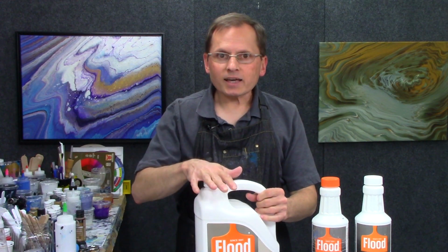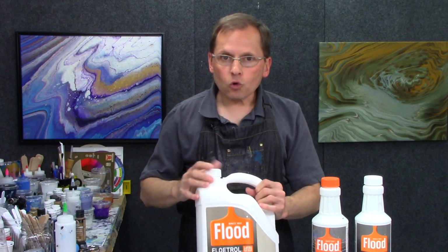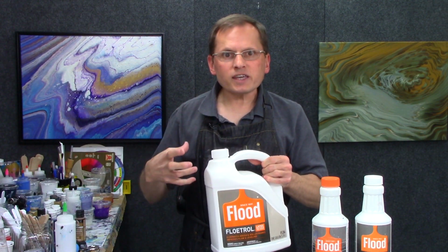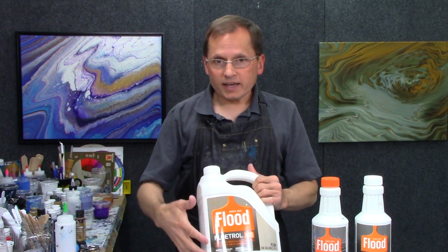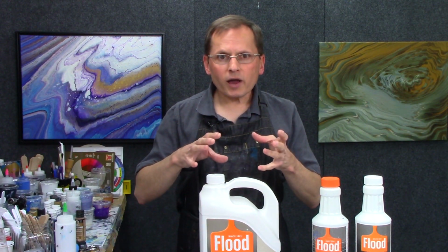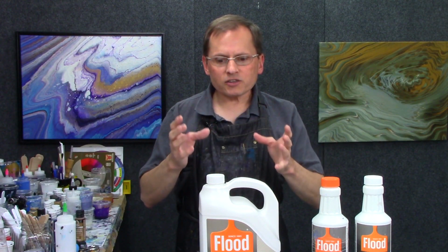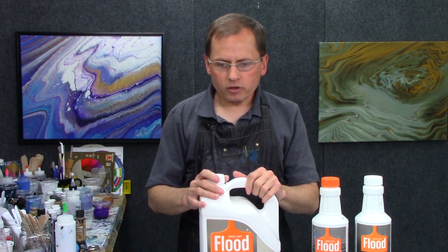So I always kind of test and look at my Floetrol before I buy it. The other thing that's notorious with a Floetrol is it can develop chunks and stringy things in there. And I have a feeling it's because of the latex nature of this product. I think once it's sitting around, it can just kind of congeal and get some chunks and stringy stuff, and that will totally screw up our painting. So we need to get that out of there.